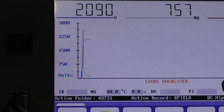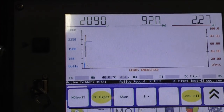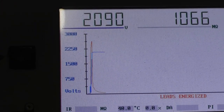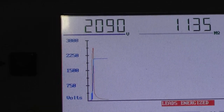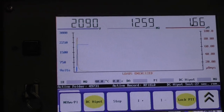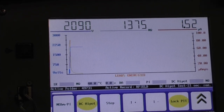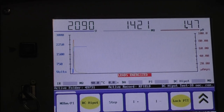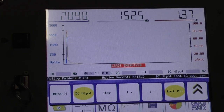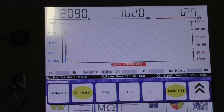And we're going to hold it at this voltage for 1 minute to get this full high pot test. Now, if this red line were to have kept climbing, it would have automatically ended the test, indicating that we have a short. So it's looking good so far. We still have 30 seconds left. You rarely see it end in the middle of the test, so if it doesn't end right away, we're usually gonna be good. So just gotta wait for it to end, and the test after this will be the surge comparison test.